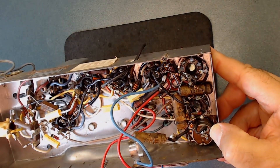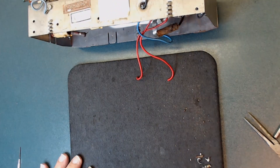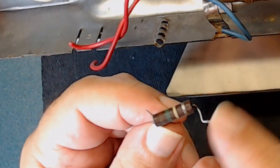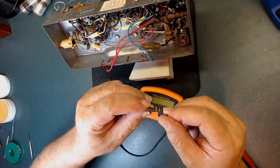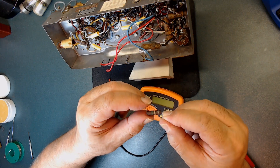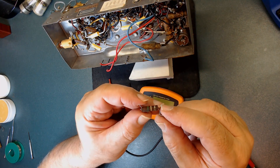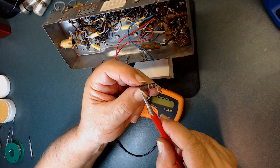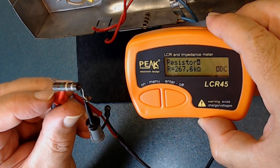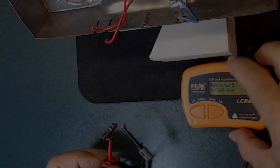These two pins were totally cleaned — everything came off. This is how much garbage was under there; there were tons of wires for no reason, just wrapped around stuff. So I have to clean this very well. The more I dig, the more I find — that's what it is. You should be patient when working on this type of thing; do a little bit at a time so you don't get overwhelmed. I removed this resistor to be able to clean those two pins. The colors are hard to tell so I'm going to look through the schematic to find out if this is the right value or not.